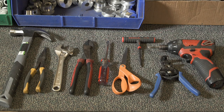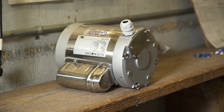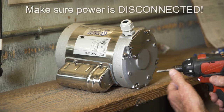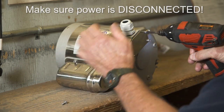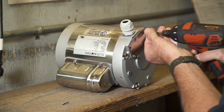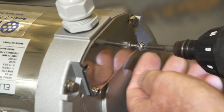Here are the kinds of tools you will need for the wiring job. Let's get started on the wiring. Of course, the first thing you always do before attempting any wiring is make sure the power is disconnected. Begin by removing the screws on the cover over the wire housing electrical area on the motor.